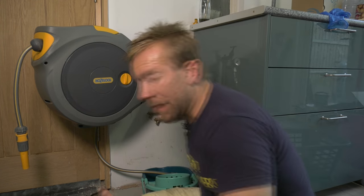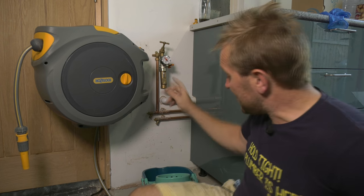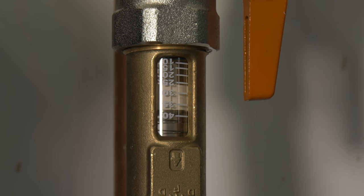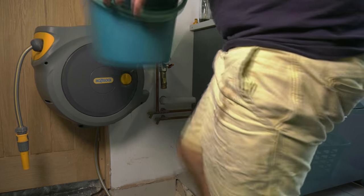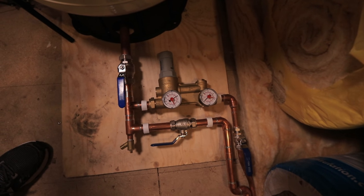The vessel is replenishing upstairs in the loft. Our flow rate is now roughly about 25 litres a minute — a lot of litres. And I just tested opening the taps simultaneously to see if the kitchen tap issue Emily complained about earlier still happens — it doesn't. It also solved the problem of the washing machine cutting in and drawing water, making the shower suddenly go hot or cold. Because we now have this extra injection of stored water ready to go, it's not coming through one 15 mil pipe — it's effectively coming through our 22 millimetre pipe, so we've got much better flow and much more dynamic pressure.